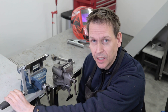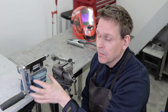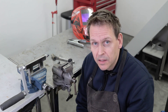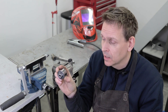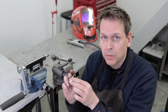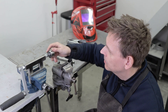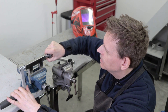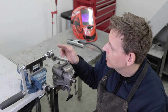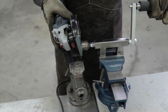The turning machine — the crank turning welding support machine is done. The feet make me able to put this at a suitable height, and then the second thing I made was the adapter, which is made of a small tube with the same diameter as the tube I will be welding. So it's a part of my exhaust. I welded on a nut there, tried to get it exactly at the center, and I also used my grinder to even out this so it was not out of alignment.